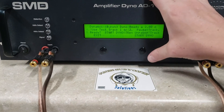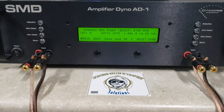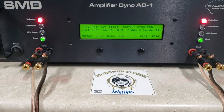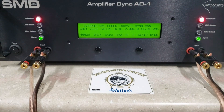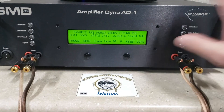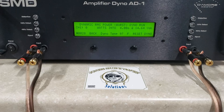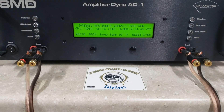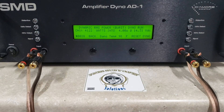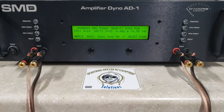That's impressive. 2 Ohms, starting at 14.6 Volts again — 7,669 Watts at 2 Ohms, dropped to 14 Volts on that. And 4 Ohms. Similar to certified on these scores here — 4,164 Watts, dropped to 14.3 Volts.